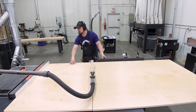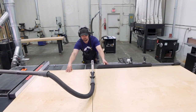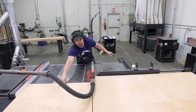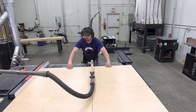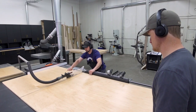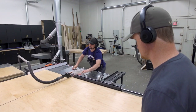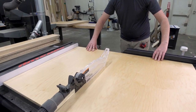Which it does, so my thinking is that the plywood has some tension in it, and just like hardwood, when I'm cutting, it's pinching the riving knife and making it hard to push. And before you assume it's my fence alignment, it's definitely not. My fence is and always has been dead nuts. And here's Cody doing a beautiful first cut. His past expertise is paying off already.